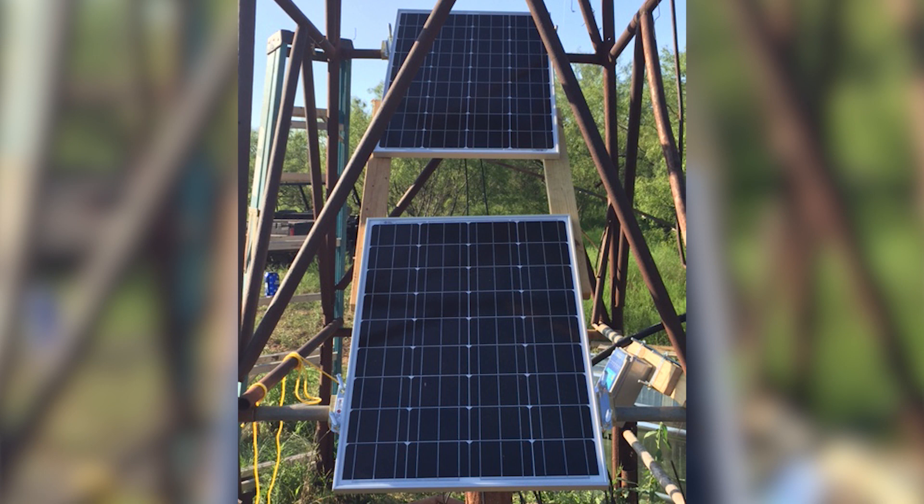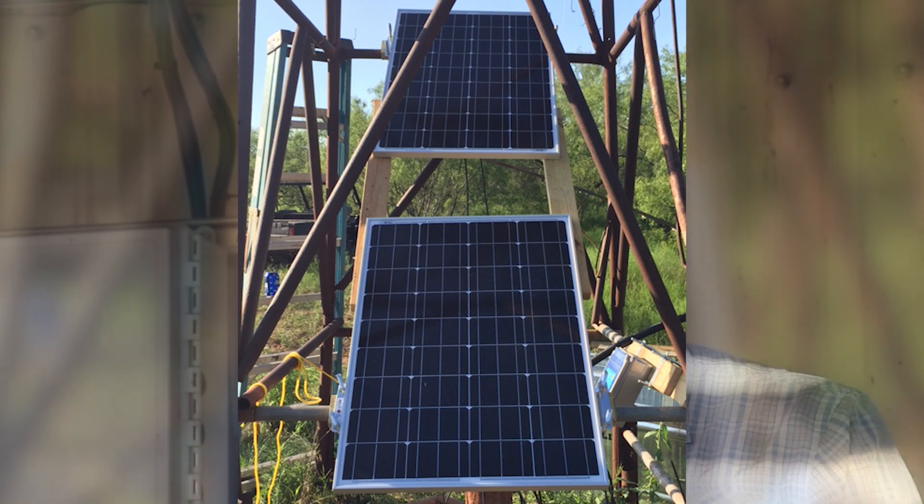A lot of our systems are also used with windmills, which act as a great mounting structure, but you need to make sure you're not mounting your solar panels where angled beams cause shadows on your array. Here you can see two panels in our RPS 200 pump where the windmill structure was causing shadows and significantly reduced production. By moving the panels to the outside — still mounted to the windmill — they were able to significantly increase their production. These are three great installations that just needed minor tweaks to maximize water production.